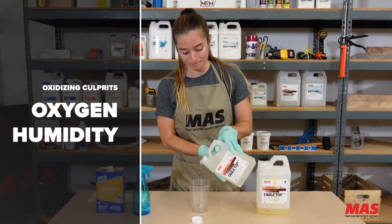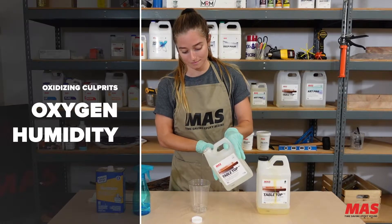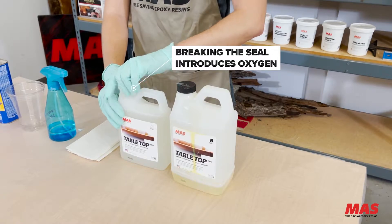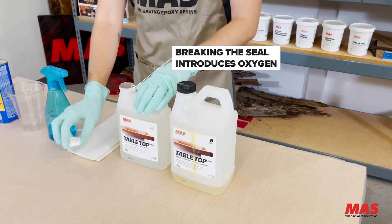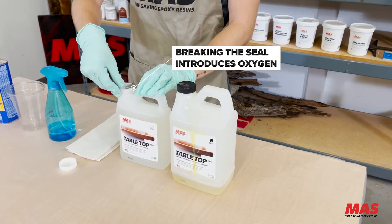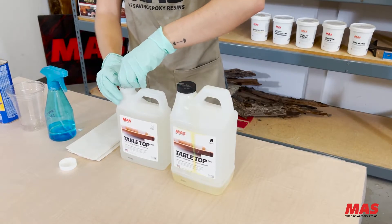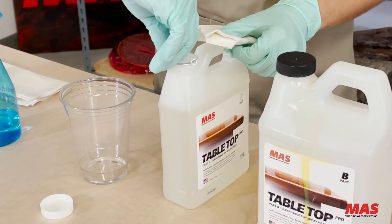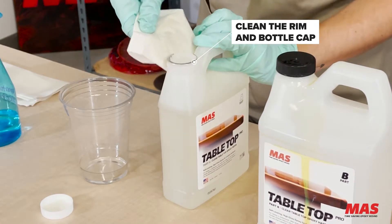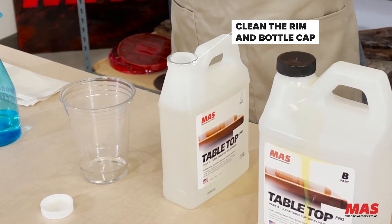This video will go over a few tips to mitigate your hardener from oxidizing, as well as some proper housekeeping to make sure it lasts a really long time. The first time you open up the cap and subject it to air, you're essentially kick-starting the oxidization process. It's not something that takes place overnight or over a couple of weeks — it takes a lot of time. Whenever you pour out the epoxy, make sure you wipe down the rim of the bottle and clean the cap so you get a really good air seal when you put the cap back on, and that'll prevent oxygen from getting into the container.